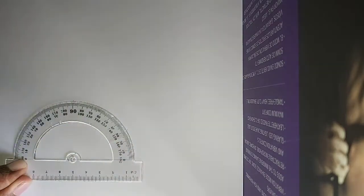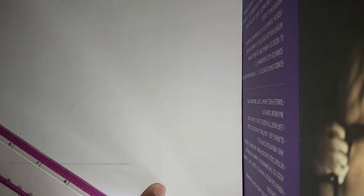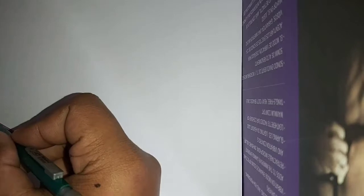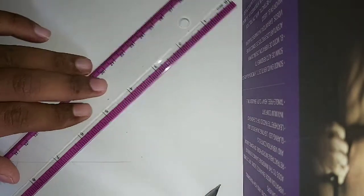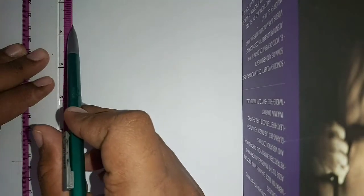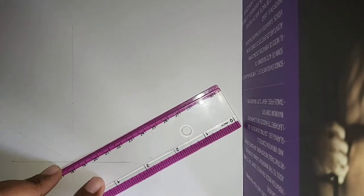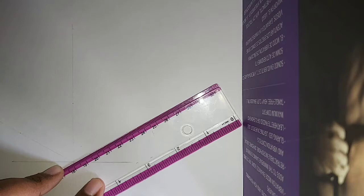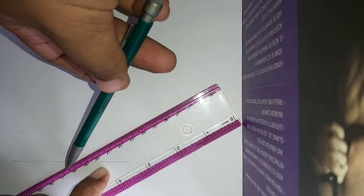And then I'm going to draw the angles. Alright, so you can see me drawing the angles here now. And this is what you usually do, right, when you start any isometric projection. It doesn't matter which shape you're constructing in isometric projection, you always do this first. You always draw the angles first.